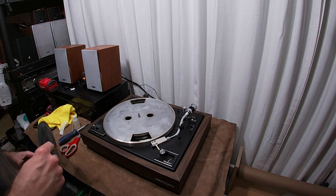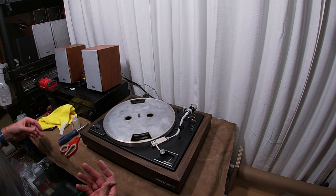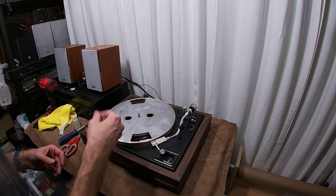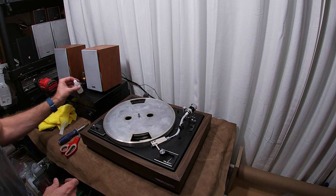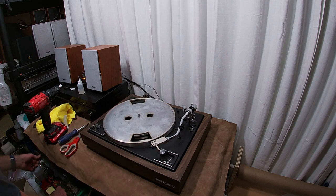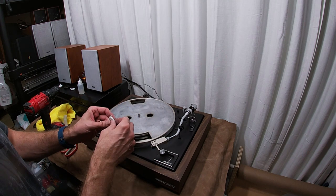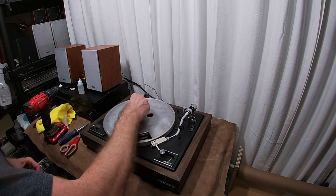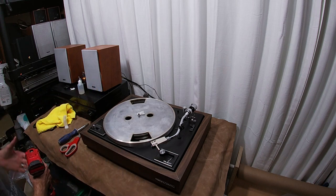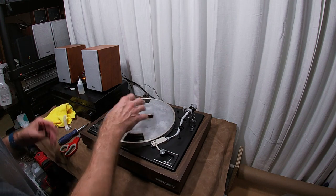Just kidding — I turned around, started to climb up the stairs, turned out the lights, and then it dawned on me what I could do to actually get this to drill out. I really needed to get that JB Weld out of there. Trying to pick at it — nah, that stuff's not going to come out. What I ended up doing was roughing up the inside lip of the plate with some sandpaper, then using a drill and some of this nice white foam grippy stuff you use for cabinets. I put it around the piece, drilled it in, then held the plate and pulled at the same time — and it worked. It pulled out all but a little bit of the JB Weld and leveled everything. Actually, it works.